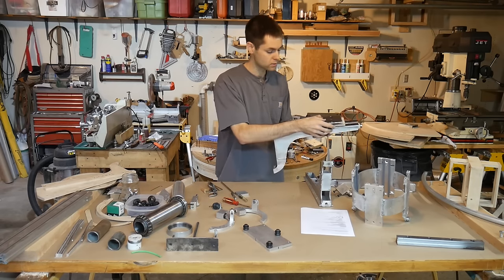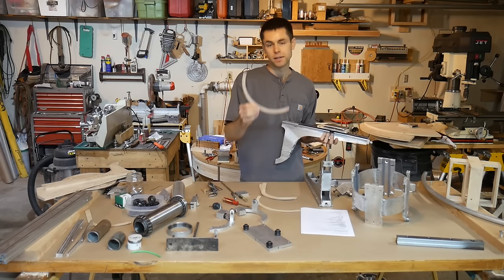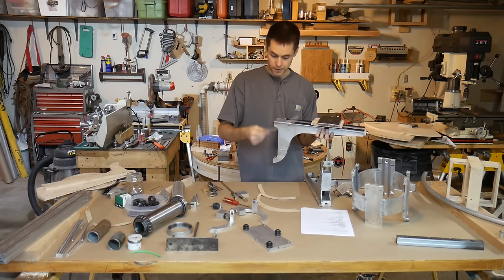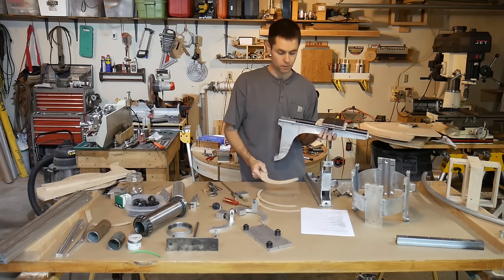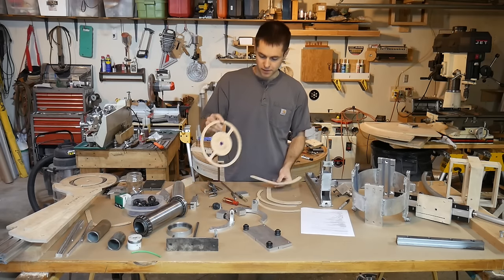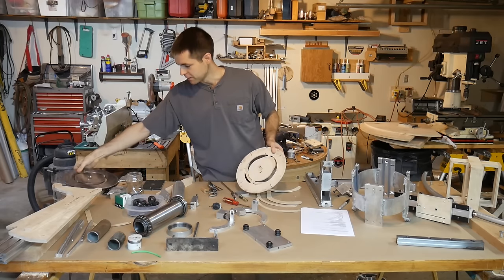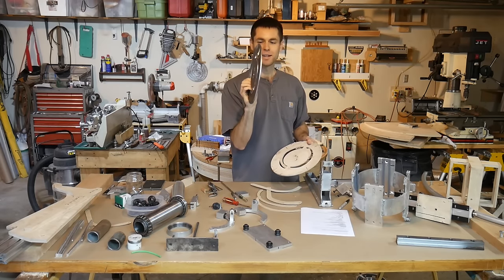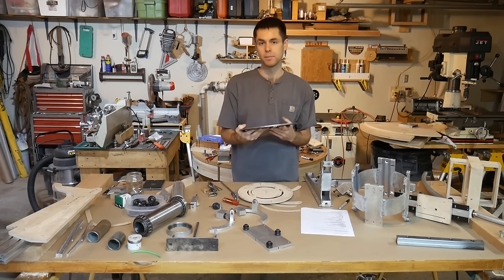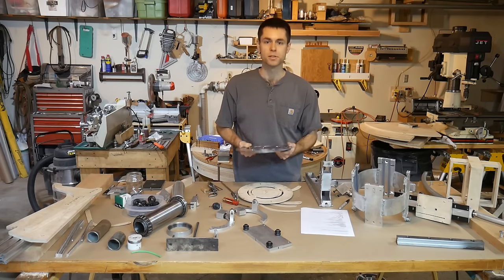The arms mount to the front of these carts to push them in and out. The arm shape is always kind of a time-consuming thing to develop. I tried to use nice arcs and work that out, but it doesn't work — you end up with more of an L-type shape. So I made these out of wood first because it's time-consuming to make them out of metal. These arms have to mount to something in the center, and that's this octopus-type plate. That started off looking like this, then evolved into something like this which actually got some use — hence all the dirt — and then it evolved into this, which is made out of quarter-inch hot roll steel. I need this almost entirely open on both sides, so I need the maximum amount of stiffness, and the elastic modulus of steel — basically the stiffness — is about triple that of aluminum. So steel it was.